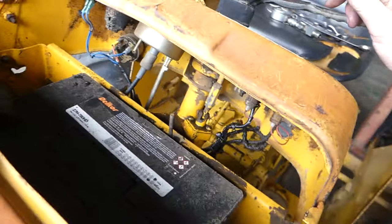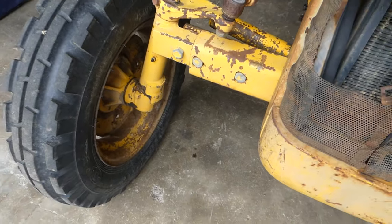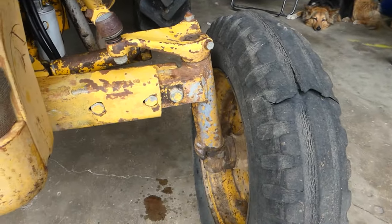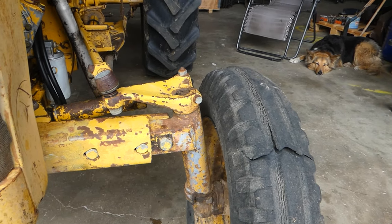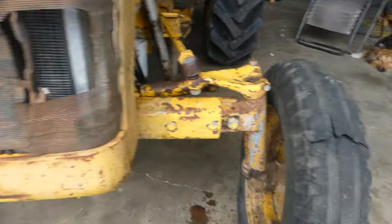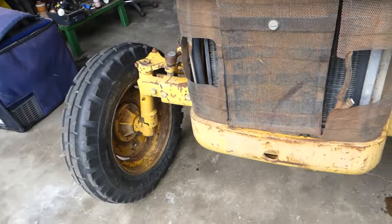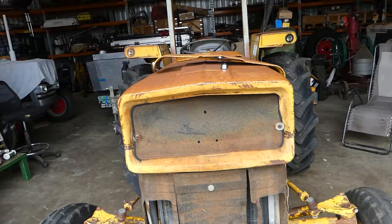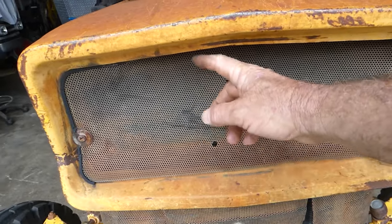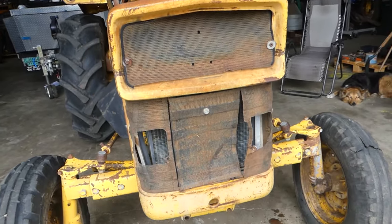I've got an O-ring kit coming for this valve — I doubt it's the valve, I think it's probably the pump. This front axle will come around. This is what a front axle should look like — they've got like half a cover with the bearings a little bit in the open. This other side has had something else put there — it's grey and may be off an early 135 with a solid axle or something. That's going to get fixed up, and the kingpin doesn't come out through the top there. I do have new ram seal kits — power steering cylinder kits — on order.